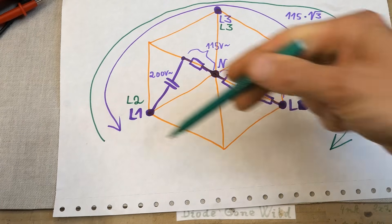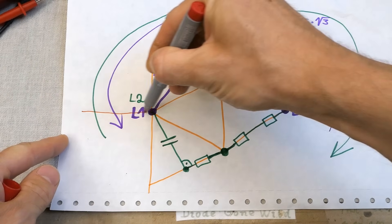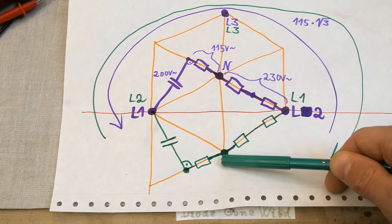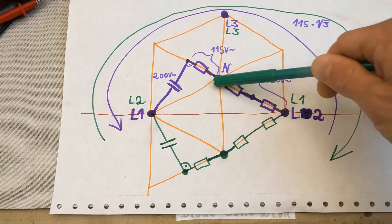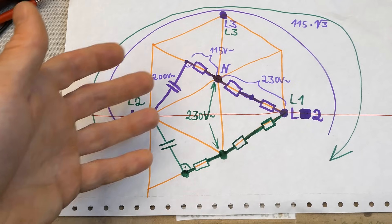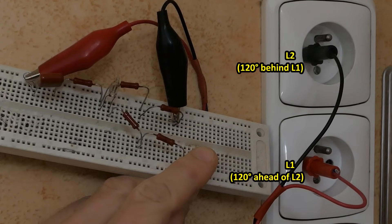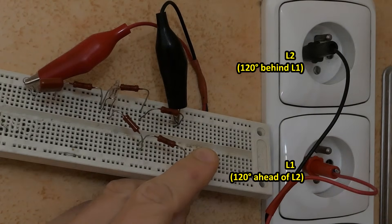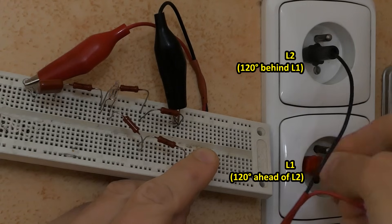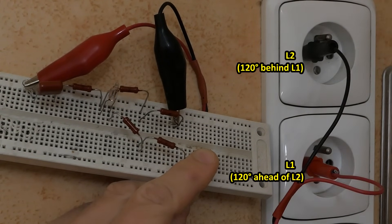Now let's draw what happens if it's rotating the other way. The RC circuit is basically flipped around the axis between the two phases, and the center spot ends up at about 230 V against neutral — essentially the full phase-to-neutral voltage. Hopefully this explanation makes it more comprehensible. Testing time: in the direction when it's not lighting up, the lamp stays dark. Interestingly, when you unplug one phase or the other, it lights up. Only if both phases are connected does it actually cancel out and the lamp not light up.